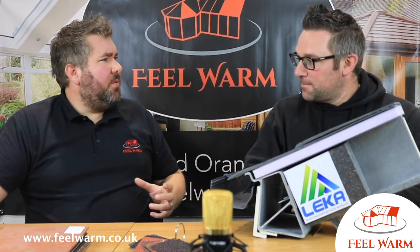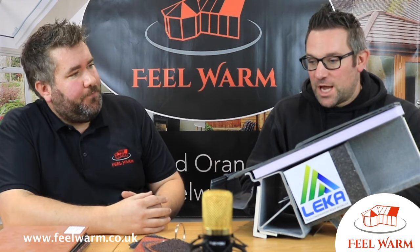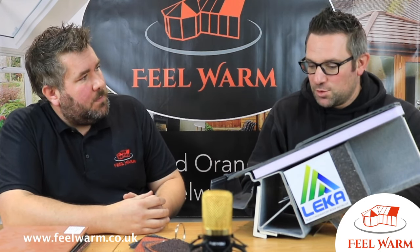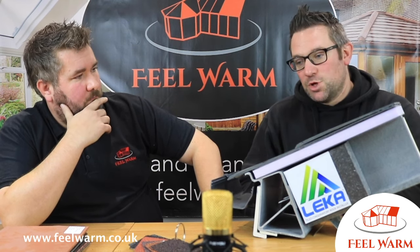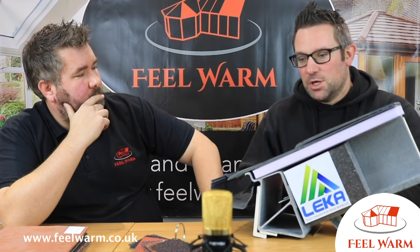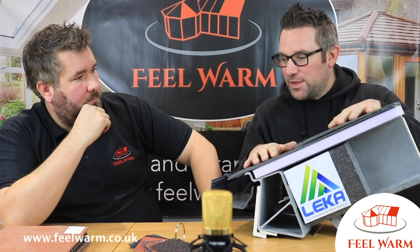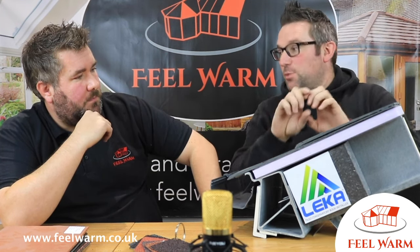Those insulated plasterboards as well, they're really heavy, aren't they? They are heavy, yeah, absolutely really heavy. You can't say that popping a load of timbers around and putting some screws in it is good for structural integrity, because it's not. What you find a lot with conservatories, especially long ones, is a product called tie bars that we use in conservatories quite a lot. You might find you've got a polycarbonate one that didn't need a tie bar, because the computer, when it was put in, didn't spec for it. Now, if a tile roof is about the same weight as a glass roof, then it might say, well, you need a tie bar in it.